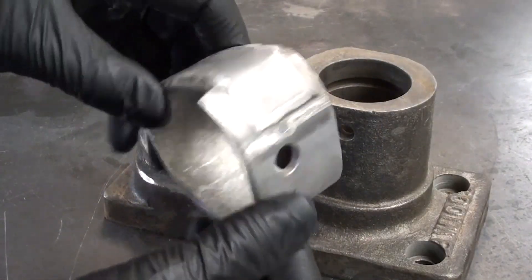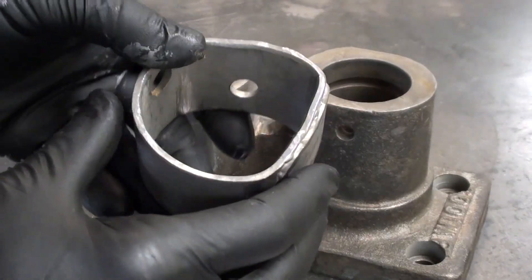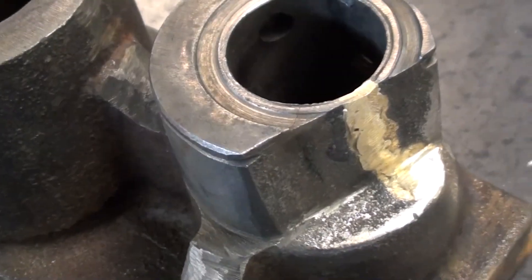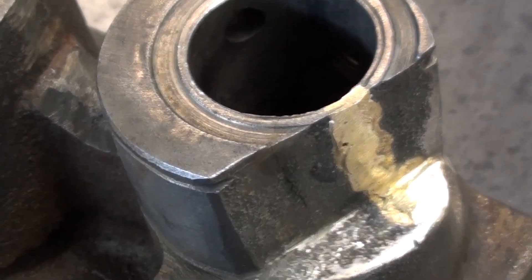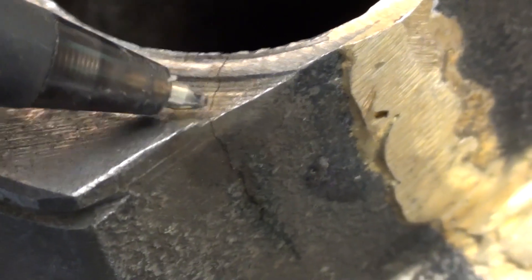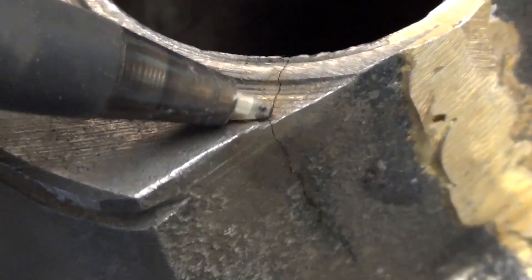The sleeve washed down and cleaned up real nicely with muriatic acid, and then I washed it and the housing down with lacquer thinner. But when I was washing down the housing with lacquer thinner, I discovered there's another crack right there. I don't know when that occurred — I presume it's always been there and we're just now noticing it. It may have gotten pulled loose a little more when the brazing was done.